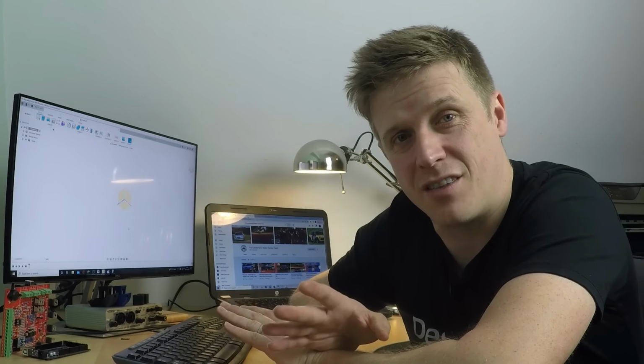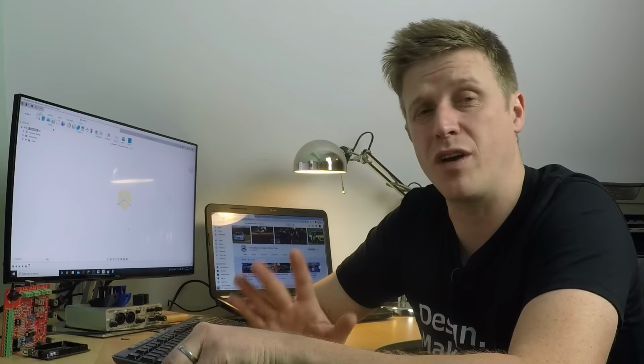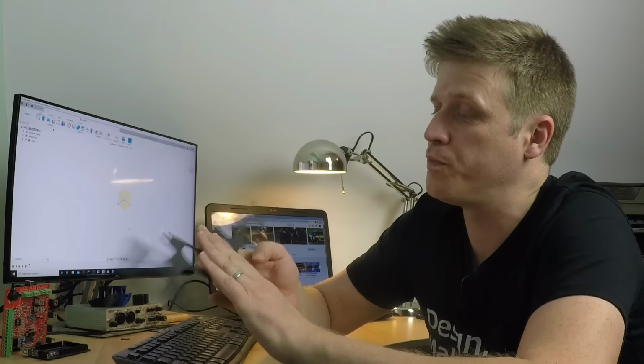So it's time to get into the main event, the individual throttle bodies manifold. So we're going to use this, which is an inlet manifold gasket, as a template. I've offered this up to the head and it's very accurate, it's about perfect. So we need to get this into there somehow.